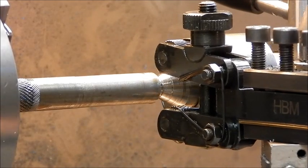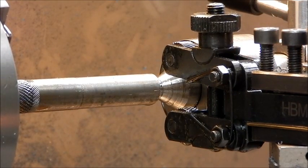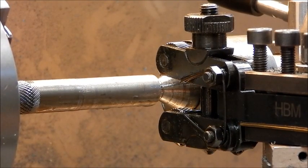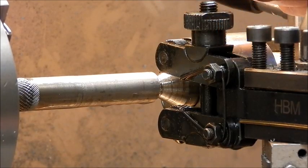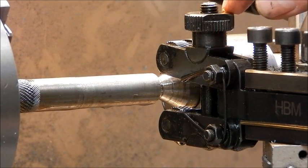Once you're in finger tight position, you back it off. Spray the job with a bit of lube. And then you put your lathe in bottom gear — slower speed — and you adjust up the knurl knob for the depth of cut you want to put in.